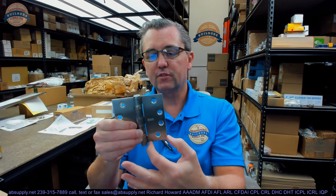For commercial applications you'd expect 4-and-a-half by 4, 5 by 4-and-a-half, et cetera — larger, taller hinges. This is likely a residential application dealing with inch-and-three-quarter thick doors. Inch-and-three-eighths doors are not the right thickness for a 4-inch hinge; I should say a 4-inch hinge is not the right size for an inch-and-three-eighths door — it's just too large of a hinge.